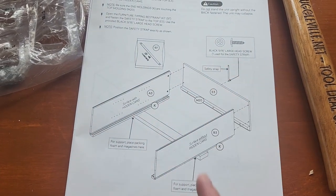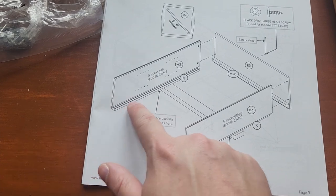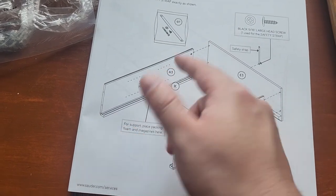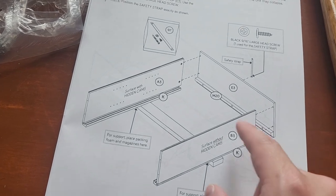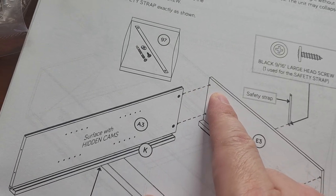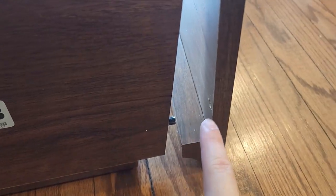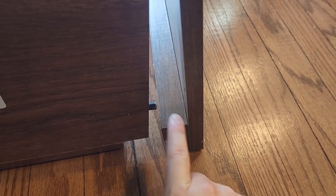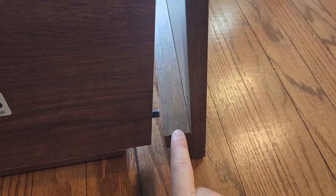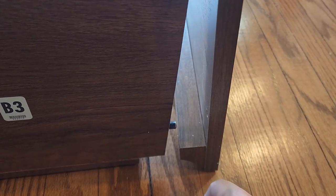For the next step, we're putting together those three pieces — A3 and B3 on the sides, E3 on top. The moldings we just did go along the floor with the shelf-adjustment holes facing inside. On E3 we have the molding across the bottom, and the four hidden cam dowels go into holes on E3 which we then tighten. I ran into a snag: the lip here sits on top and I'm hitting the molding so the dowel is too high and won't fit in the hole. So I loosened the screws a bit so the piece can move, got the cams in, tightened down, then retightened the screws.